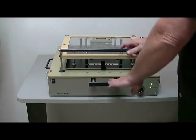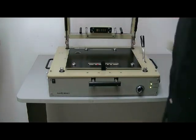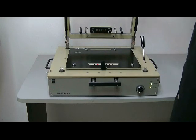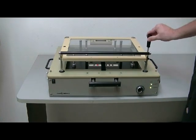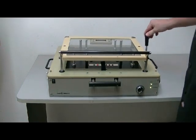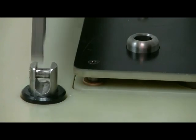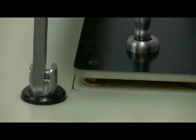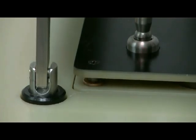You typically don't see this done with single-sided traditional test fixtures because vertical travel is an expensive option that companies generally won't quote. The second feature of the system is that all docking stations can perform a test cycle in two ways, both manually and pneumatically. A third direction is where a test cycle can be done electrically through programmed test files, the same way that all in-circuit test systems work.